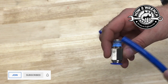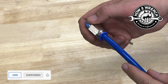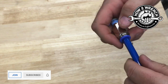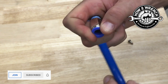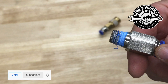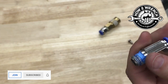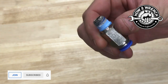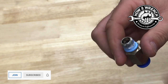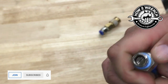I wanted to show how these work, because it makes me wonder if I have any other restrictions where I've used these on an air tool or something — I don't want that in there. Basically, you take your appropriate size line and just snap it in — hit bottom and it's tight and good to go. To release it, pull the blue tab down and pull it off. What I noticed is once I push this line in, that screw is loose in there. What this does is it basically holds the air so you could continue working in the system somewhere else — it acts like an on/off switch.